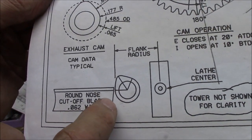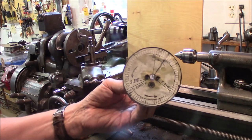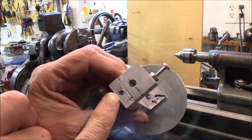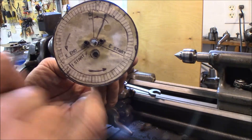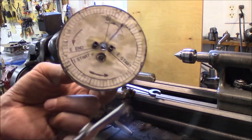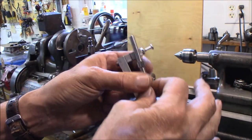You can see this is a depiction of the cutoff tool and the cam lobe. We'll go over to the lathe and take a look. This is the CamCat — it's an offset turning device. In the base I put center holes. You can see exhaust start, exhaust end, intake start, and intake end. The arrows tell you which way to turn the needle. The camshaft with the two blanks, which are just half-inch round discs, go in here.